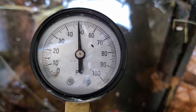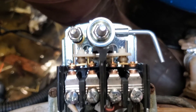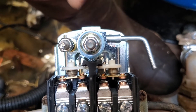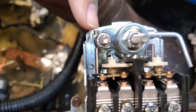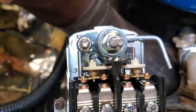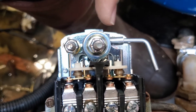This thing is exactly set up the way we want it. The reason it's going up and down right now is we do have a yard hydrant turned on. In summary, this middle screw right here raises your cut-in and cut-out pressures together. So by tightening this screw, it increases the cut-in pressure — if it was 30, turning it one turn would make it cut in at 32 and cut out at 52. And then this screw over here only raises the cut-out pressure, so you could even have it do 30-60 if you wanted to by increasing the tension on this screw.